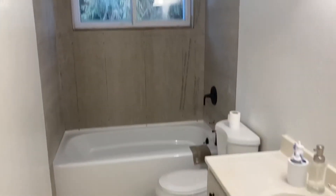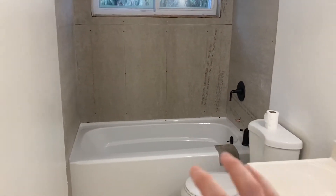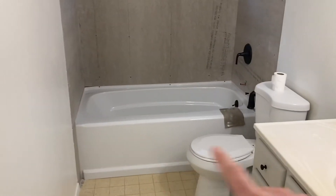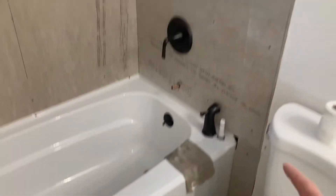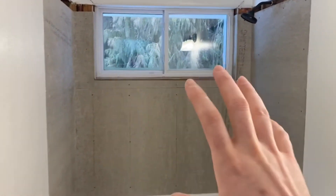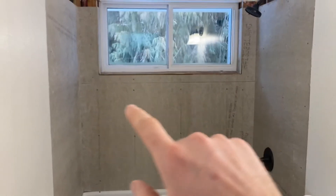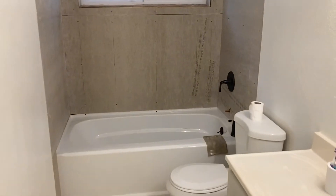We may have done a few more steps since I dropped the tub in place. Those little black screws you can see are securing the tub itself to the studs so it can't go anywhere — nice and square and level, because you want the water to drain. The tub already has a sloped base, so you want it level for tiling purposes. We've got the concrete board installed as a waterproof backer for tile, so if any water gets through it's not on drywall. We may add more screws, and then we'll do some waterproofing before the tile.